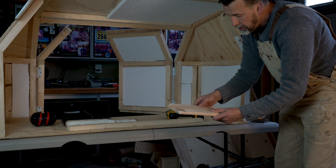Once I have it weather sealed I think it's going to be a nice tight fit. I need to take my table saw out and rip some small pieces at different angles. So that finishes up the extension except for the floor — it's completely coated in cedar on the interior, insulated throughout the hollow core with styrofoam, and finished on the exterior with plywood that currently has just a base coat of paint. For the exterior I'm going to add a few more layers of paint and then a marine-grade varathane for a decent weatherproof finish, plus weather stripping on the cracks where the doors open to make it as weatherproof as possible.